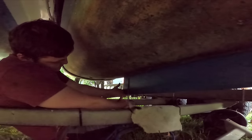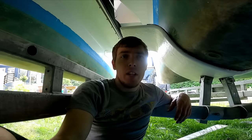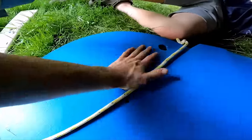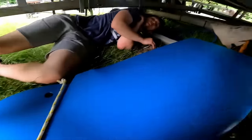Problem - it doesn't fit. The thickness here is a bit too much. It's close but a bit tight going up, and that back end won't want to pivot out, so we've got to lose a bit of length, or at least on the top corner. I'm going to double-check the measurements against what it's meant to be and see if I can make it fit. It's a bit of a shame we painted it all, but I'm going to have to get the belt sander out and attack it again. Back underneath Mingalay, and we have the final revision of the centreboard. We had to take a bit of thickness off one end and added a radius to the end where it swings down. This should hopefully slide in and we'll be able to finally fit it.